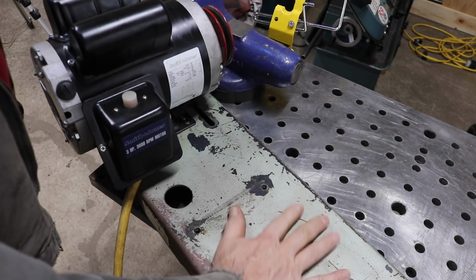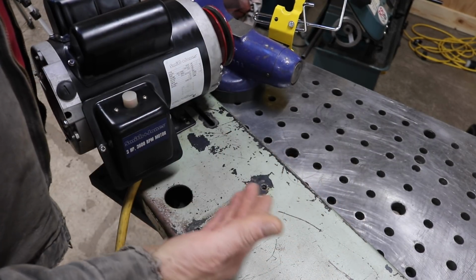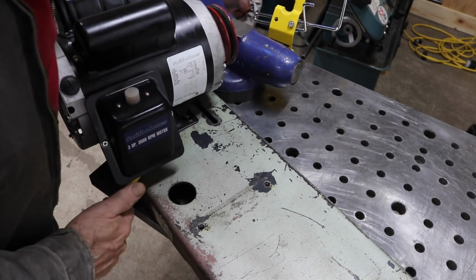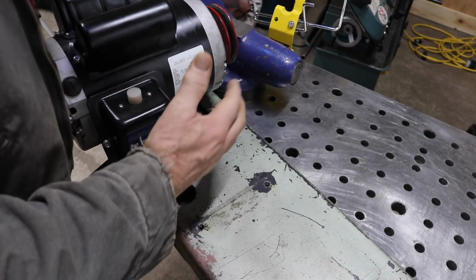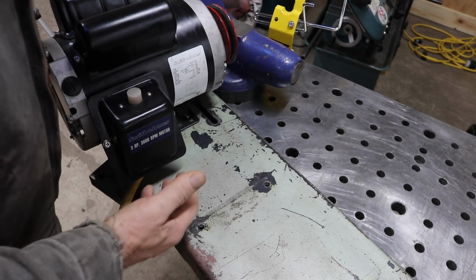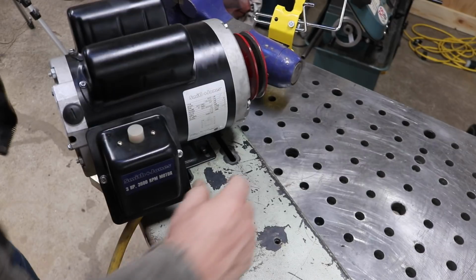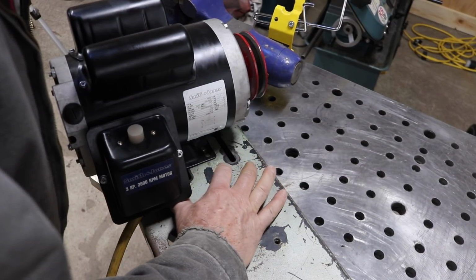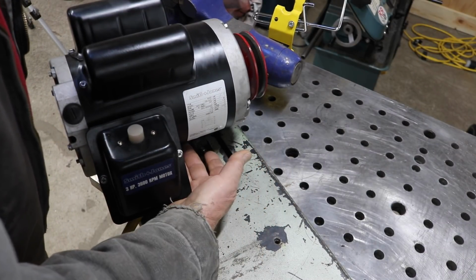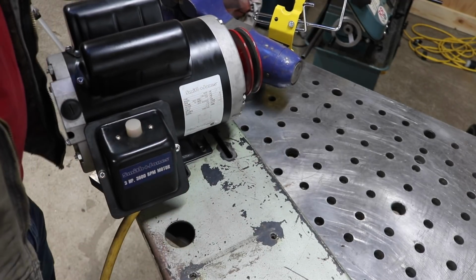So the compressor sits right here. This is the motor. And when I was testing it all, I had to adjust the belt tension. And I couldn't just pull it by hand tight enough really, and I need to make a tensioner for it. So right in here I have some room, and I'm going to build a tensioner to push on the base at the base of the motor, to push the thing straight over so we can get the belt properly tensioned.